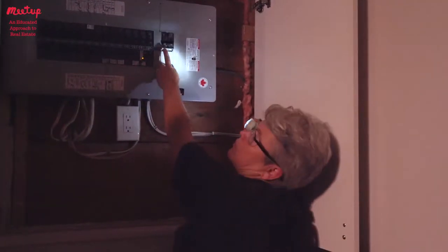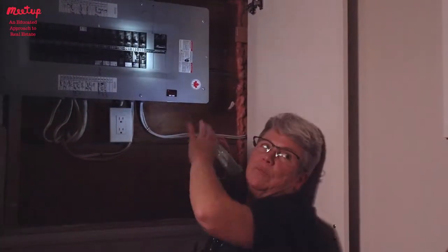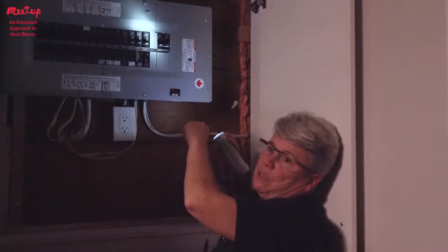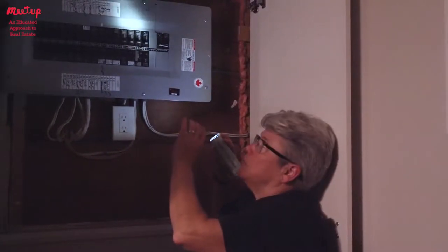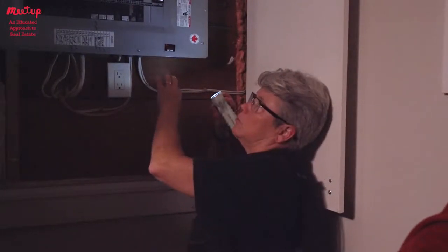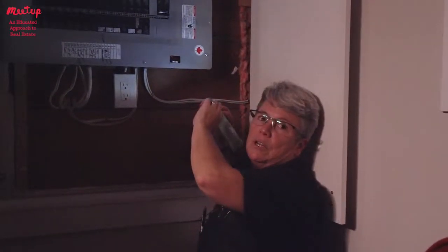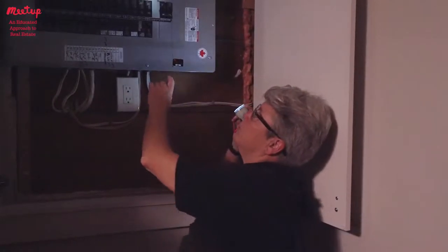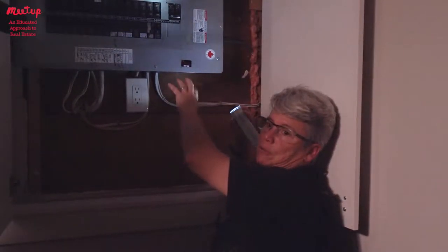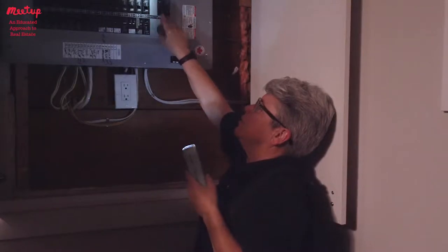There's the main breaker. For a single-family house, you should have at least a 100-amp circuit breaker. When we were outside, we checked the size of the main electrical mast coming in to make sure it's the standard for 100-amp wire. Sometimes on an older house, you'll see a very old, skinny metal pipe — that's a 60-amp size. If you have a 60-amp wire coming into a 100-amp breaker, you can have a fire hazard because it could overheat. This one looks fine on the outside and matches inside — it's a fairly new panel.